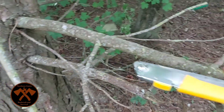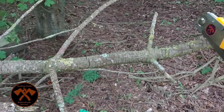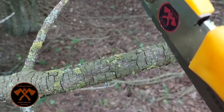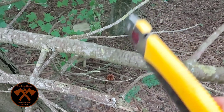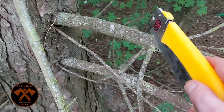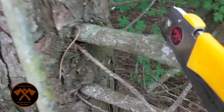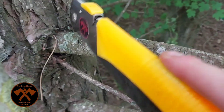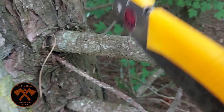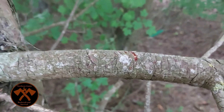You'll need a folding saw, preferably. First of all, I'm checking how much wiggle room there is. Then I tap it — listen, sounds quite hollow. Moving along, it sounds a bit more stable. Moving down to the next section, that sounds quite solid. Moving a bit further down, that sounds absolutely solid. So what I'm doing is tapping until I can hear an actual change in tone, and I've just marked where that tone change was.